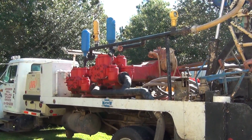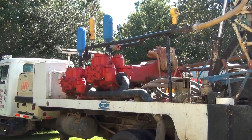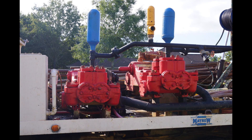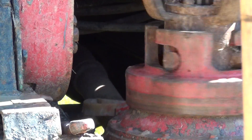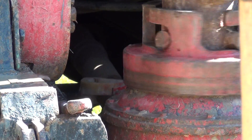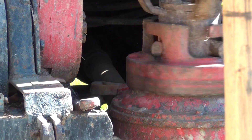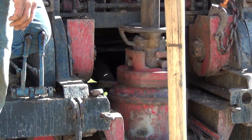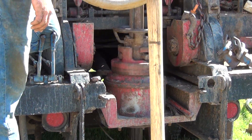The two red hydraulic units are powerful mud pumps used to circulate the drilling fluid. The blue pieces on top are dampers that smooth the flow of drilling fluid. The red unit is a rotary table. It is driven by a drive shaft that is connected to a five-speed transmission. Different drilling speeds are used depending on the type of material being drilled.